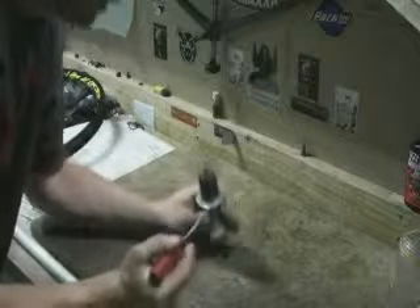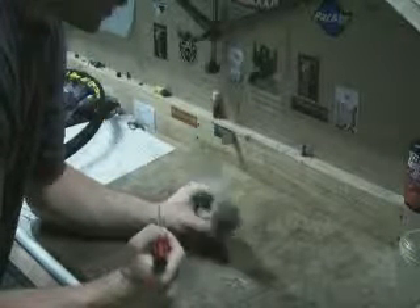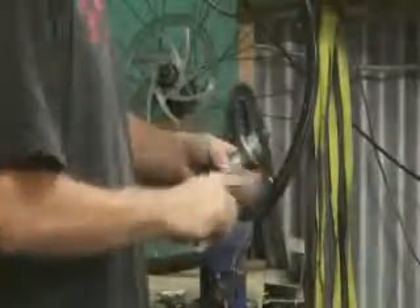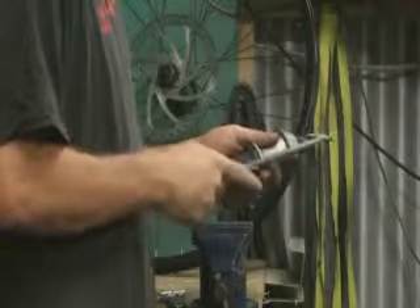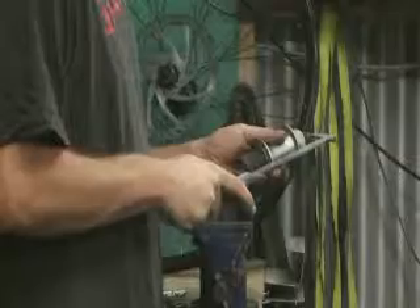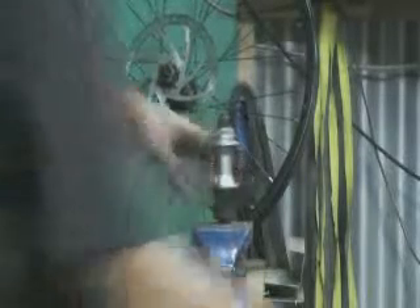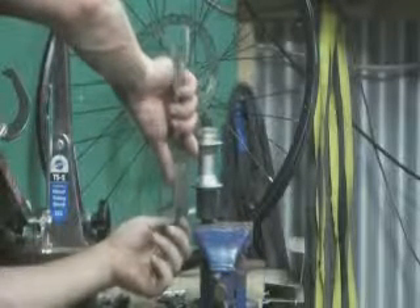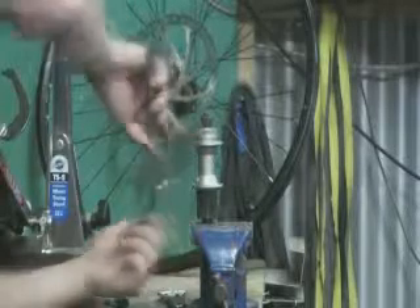To get the measurements we're going to need the distance between the centre and the flange, and we're going to need the diameter of the holes. The first thing we need is the complete distance — measure that up with a set of vernier calipers or a tape measure. Then we're going to need the distance from here to the flange, using a little vise. Just measure from the vise up to the flange — that's going to be our measurement there. Our next measurement is this distance.